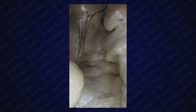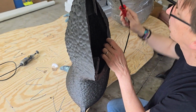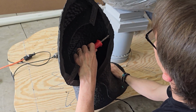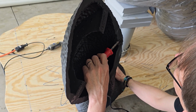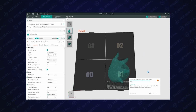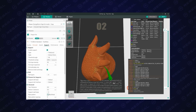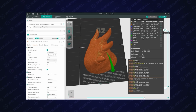The second trick I'll be using is slicing the legs into multiple sections. Sure, my Giga printer can handle printing the legs in one go, but remember what I said about inevitable failures? Imagine losing nearly 3 days of printing because of a failure late in the process. It's really not fun. By breaking the legs down into 3 or 4 smaller sections, each piece becomes a shorter and less risky print. Even if something goes wrong, we lose maybe 1 day instead of 3.